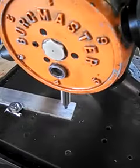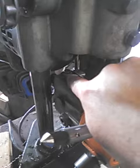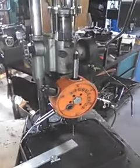Come down, center drill the hole. When you hit your depth from the stop, you come back up. There's a little button on the back that operates the linkage that indexes the turret. So when you come all the way up, it automatically indexes to the next tool.